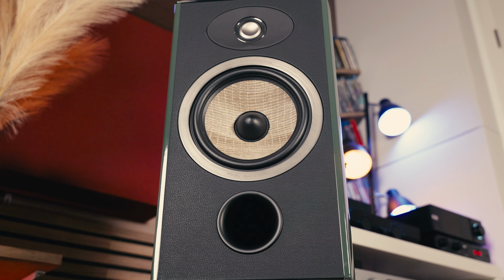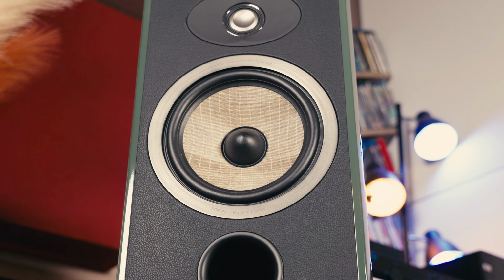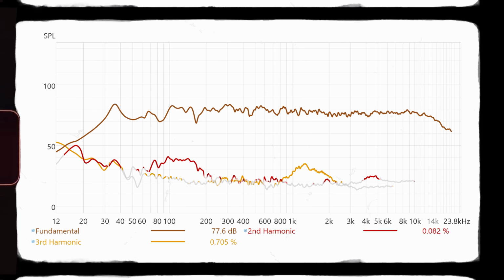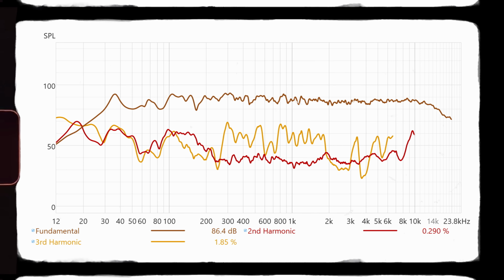The SuperNait provided a more grounded bass, but the XS3 allowed the woofer to breathe more, resulting in a longer and more engaging bass response. Despite the woofer being less controlled on the XS3, I really love this bass sound too. The Aria Evo X No.1 is a speaker that I enjoyed more at high volumes, despite not being a high volume listening lover. It has excellent distortion tolerance, with measurements taken at 75, 80, 85 dB showing only minor distortions and clipping detected only at 90 dB.